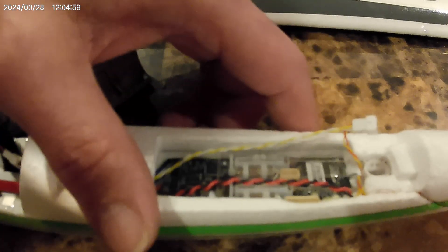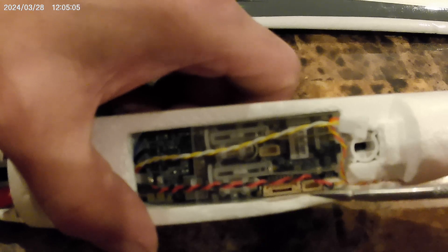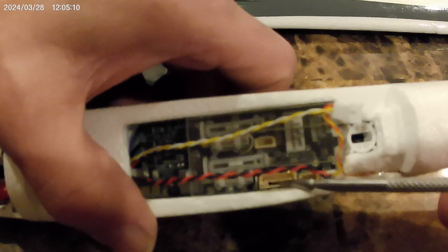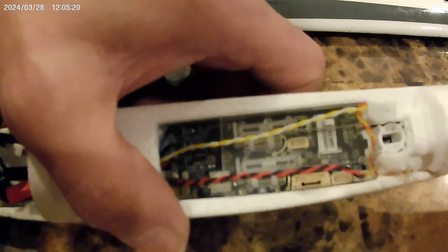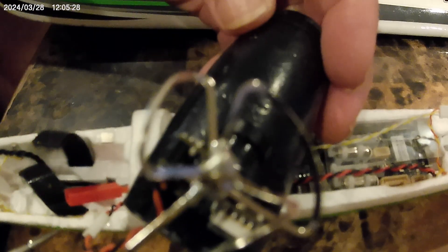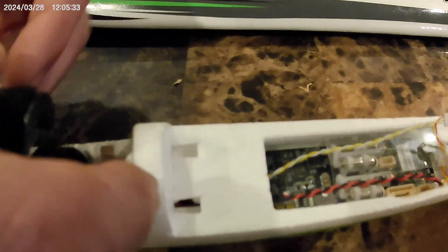On the flight control board there is a port for FPV, a port for the nav lights, and this is the aileron port. There's only three there. There's one in the middle here you could use for nav lights also — it's the same size. That's the FPV setup: run the wire through the body, come out here, and velcro it right to the top of the hatch. Now she's FPV ready.